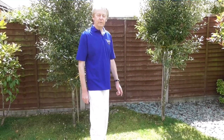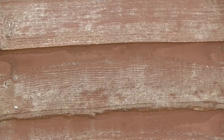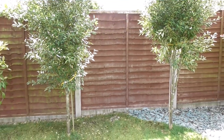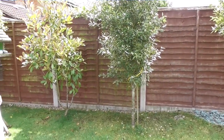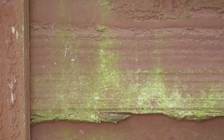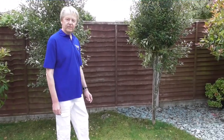Let's have a look at the fence panel we treated yesterday with the bleach solution. As you can see, there's been a dramatic transformation and all that mould and algae has now gone. So if we compare it to one that we haven't treated — the camera can zoom in on one of the other panels — you can see there's a considerable difference between the two. Now I'm all set to apply my wood preservative to the fence panel.